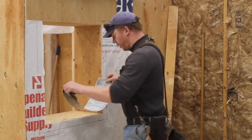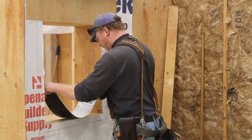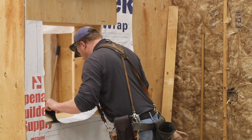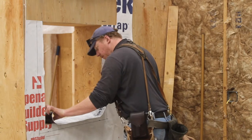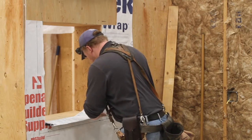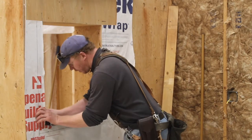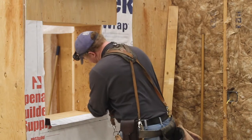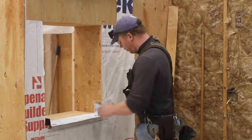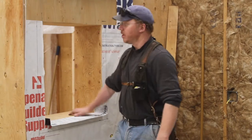In this case we'll peel the liner — you guys will have a better split release and that'll make it easier. I'm essentially going to line up to a mark on the inside here, and that tells me how far I need to go. Try to get everything nice and parallel. I like to pre-cut all my flashings ahead of time so I don't have to think about it — it's all ready to go, especially if you've got a whole series of windows where the openings are the same size.